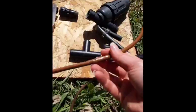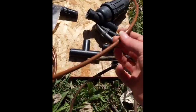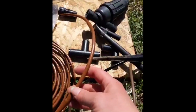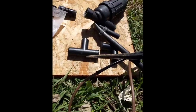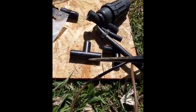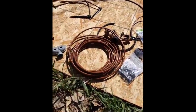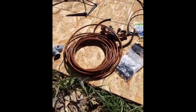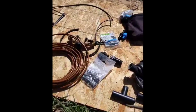You can also use spaghetti tubing that has inline emitters built in every six inches. Those inline emitters drip out at a set rate — the packaging tells you what rate, usually half-gallon, one-gallon, or two-gallon per hour. You can find this at big box stores or plumbing supply houses, with spacing from 6 inches all the way up to 18 inches depending on your needs.